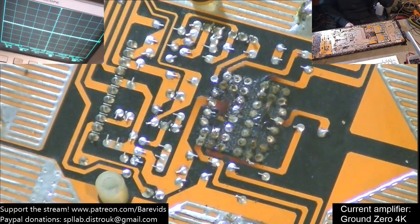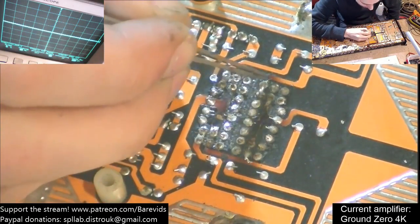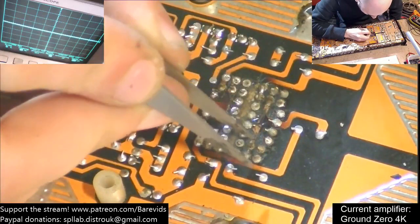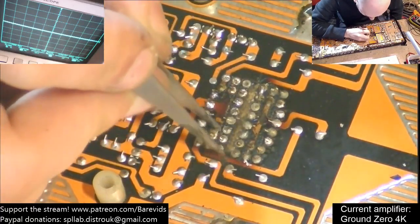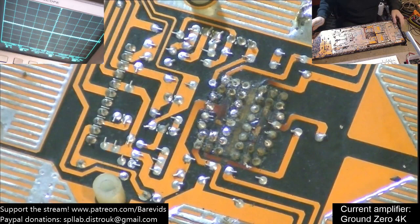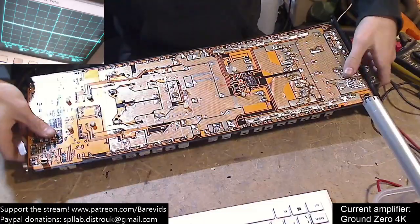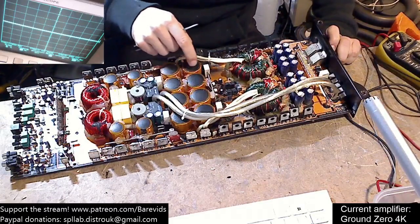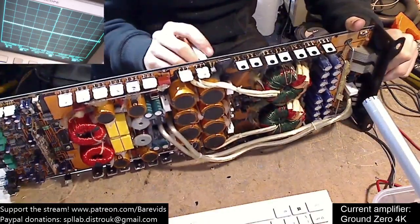The first thing we need to look at is this horrific mess of a drive transistor section. All of this is carbonized board and all the traces are either burnt or missing. I don't know if this was like this before from a previous repair or if it happened in its most recent blowing, but the board here could possibly be conductive. The big bang came from just after the screw holes, and there is a big capacitor there.